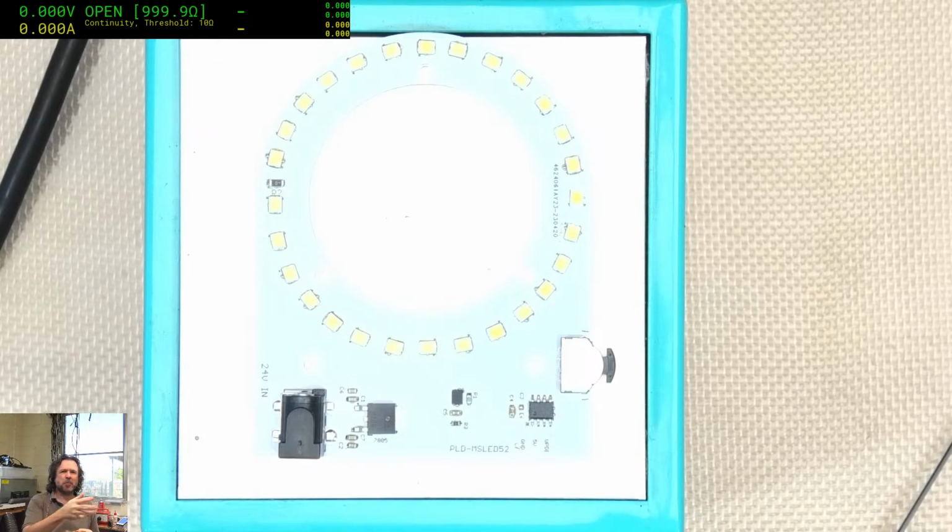Yeah, Def Bomb, the hot plate's okay for these sort of one-off jobs. Like I said, I would not like to do this as a production run. So I'll just get myself another reflow oven for the production. And I've got the controller board that I built for the drying oven. I'll just make another one of those, but I'll program it so that it will have the reflow curve that I need.